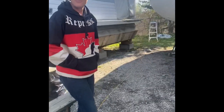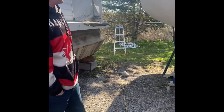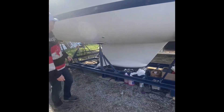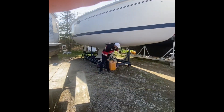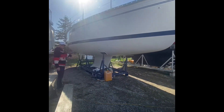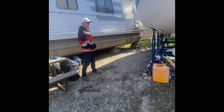I really don't want to be welding at the service dock. So the pad painting process: the first coat we had all four corner pads up with the middle ones down. Did the first coat, let that harden up, came back and put the middle ones up. Took the temporary stands to the front, set them up with a ratchet strap between them so they don't pop out. Then we could drop down the two corner pads and paint those. Came back, put them back up, dropped down the back pads yesterday and painted under there. Now I'm very happy with it.